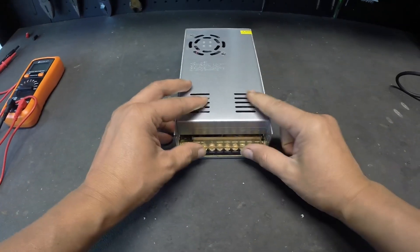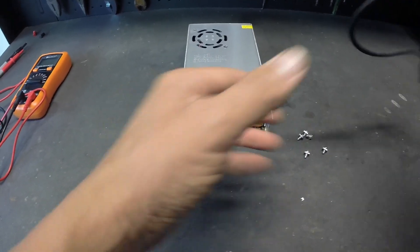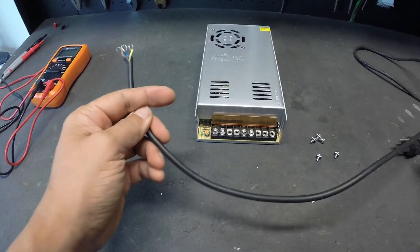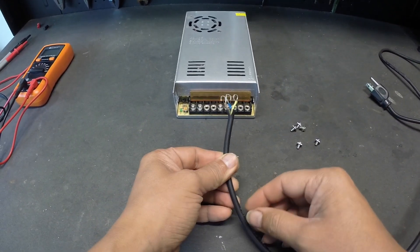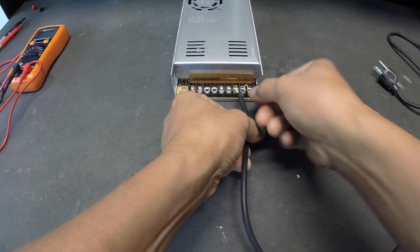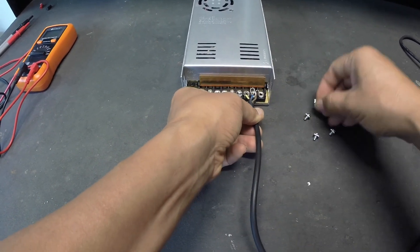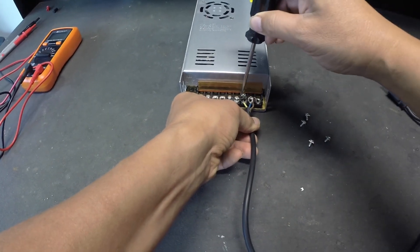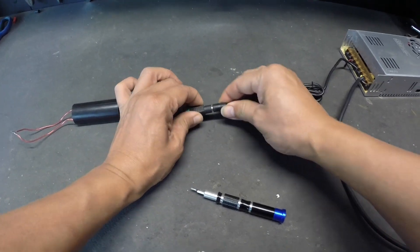So I do not power the high voltage modules with standard batteries, but with regulated switching power supplies that produce 12V DC at 30A. They can be plugged directly into an AC power outlet. They are usually well built inside. While well designed power supplies last longer, they will eventually fail sooner in an EHD setup for two main reasons. First, not all the charged particles produced by the EHD device will accumulate on the collector electrode — the power supply itself is not as well insulated, so charged particles can accumulate inside it, which can lead to an unexpected failure.